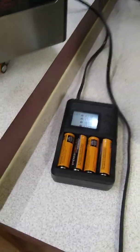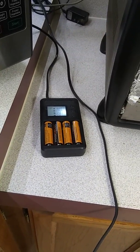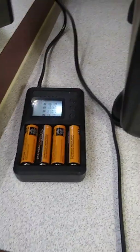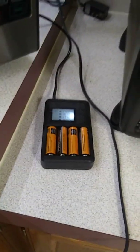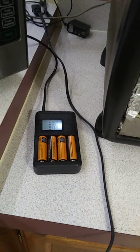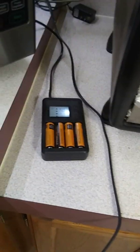The trick is to charge them if you're going to reuse them when they're basically about dead, where the electronic stuff now kicks them out. And you put them in a little LED flashlight, they'll still work fine for a long time. But they have a limit on this electronic stuff now. The computer just says, nope, they're done. Do not charge them fast. Basically trickle charge them super slow. This will probably take an hour and a half and they'll be good.